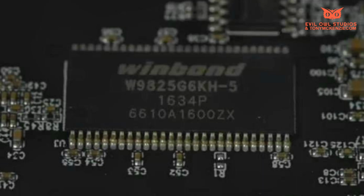It's a high-speed, synchronous, dynamic, random access memory. So it's SDRAM, organised as 4 M words times 4 banks times 16 bits. It delivers a data bandwidth of up to 200 M words per second to fully comply with the Personal Computer Industrial Standard. It's guaranteed to support minus 40 degrees C all the way up to 85 degrees C.